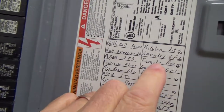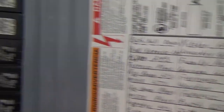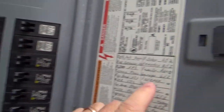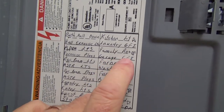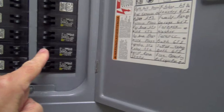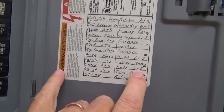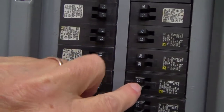I had looked on here before making another video — laundry room GFI, garage GFI. Those happen to be on 15 amp breakers because the electrician figured when you're in the garage, you only need a 15 amp breaker for your GFI out there and your laundry, since you're not going to have as many things plugged in like you would in your bathrooms. So in this particular house, those bathrooms are on 20 amp breakers. Let's remember that.